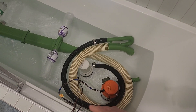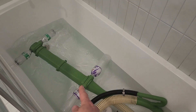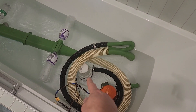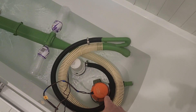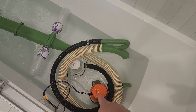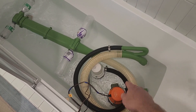It was working so well with the big pump and this smooth-bore, meter-and-a-half-long two-inch suction hose. I just wanted to see if the small pump could actually do it, and with this subsurface setup you'll pass rocks through and get suction even with the 2000 gallon-per-hour bilge pump using my impeller — that's about 120 watts. The bigger pump is about 180–185 watts, and that's what I would prefer because you want a little extra suction just to get into cracks and crevices.